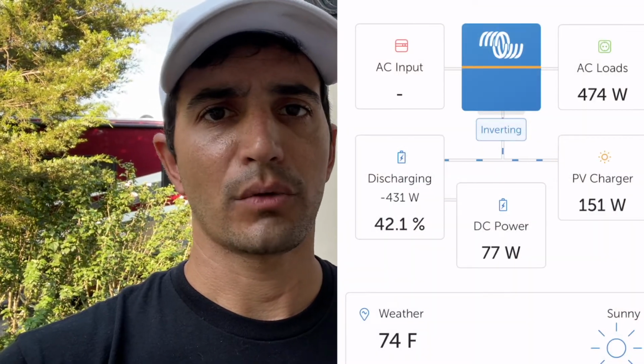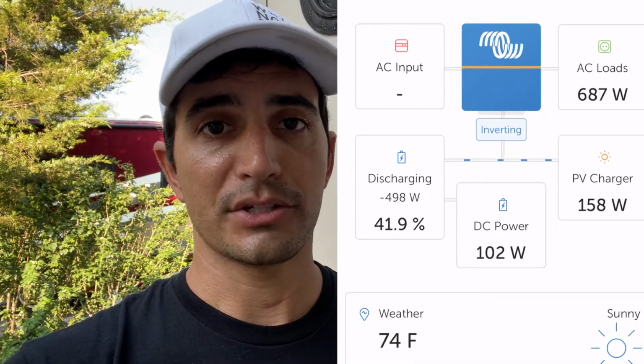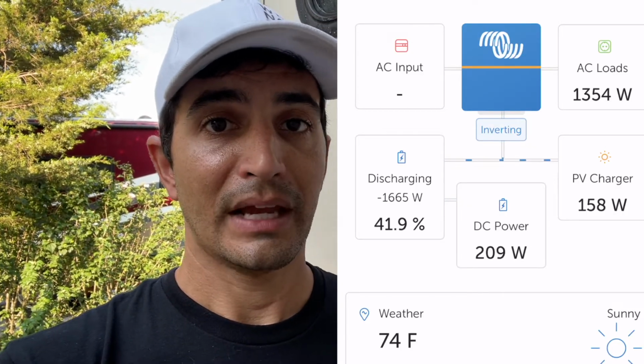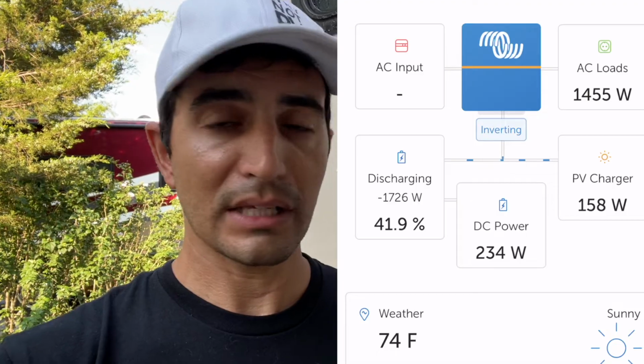And then the compressor going from the old one running about 1500 watts to now this one about 1000, because again, in this screenshot, you can see the fridge running pulls like 450, 500 watts, somewhere around that area. And the fridge is running the whole time. That's why when it jumps up, the total wattage going through the rig is only like 1400 watts. That's including the 400 to 500 watt fridge. That's absolutely insane. I cannot believe it. It's a super efficient unit.